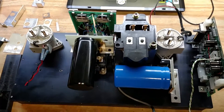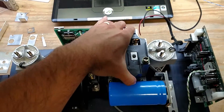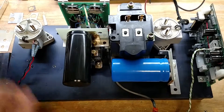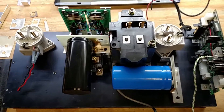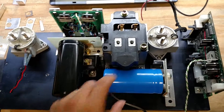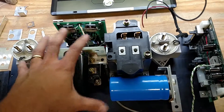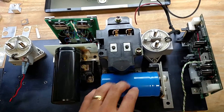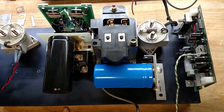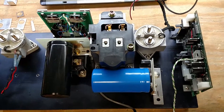Hello and welcome to today's video. As you can see, everything is now drilled and tapped and mounted to the big heatsink here — the soon-to-be power converter. My original plan of having this cap over here — I ended up moving it. I didn't like the fact that I was going to have the high voltage section mixing with the low voltage section, so I moved it out. I like this design better. I've got lots of room still for the rest of the components, so I think we'll be okay there.